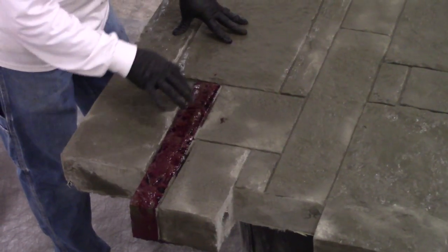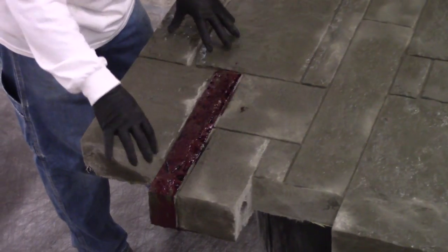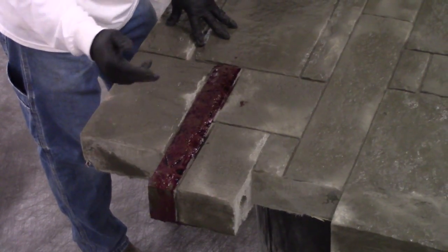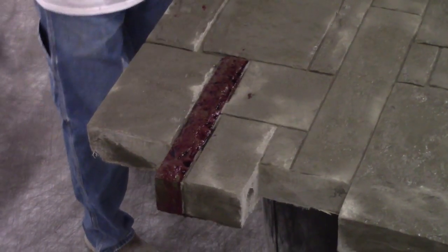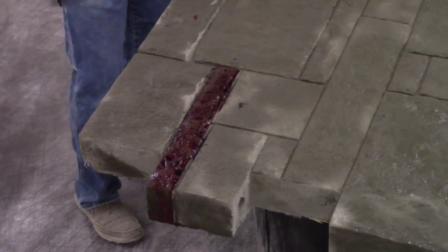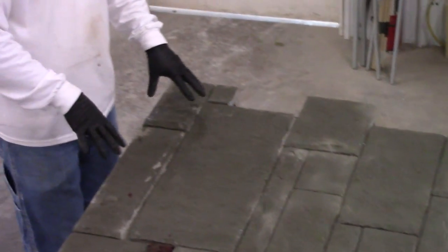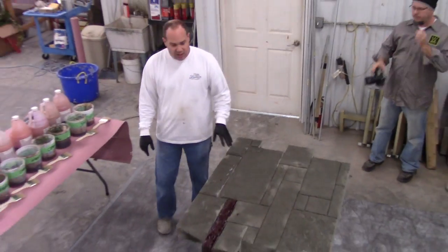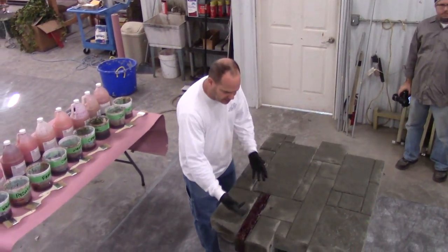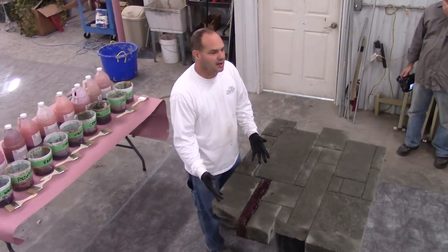You can see here that there are pits and valleys where some of the stain is grouped together and there's a lot more concentration — that's perfect. That just means there's going to be more intense color in those particular areas. With this type of stain system, flat work is really awesome because you've got gravity working with you and you can puddle things and have a lot of fun creating interesting color combinations. This first method is simple — I just tagged it with teal.